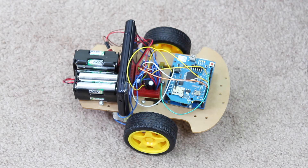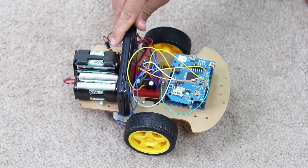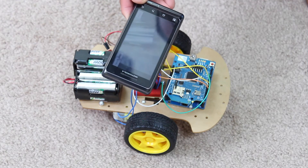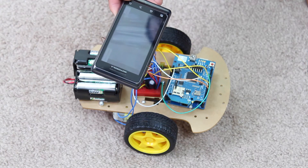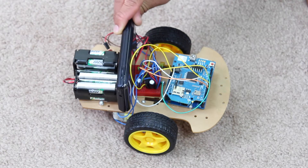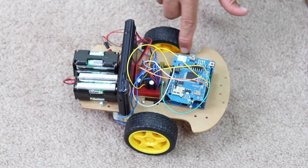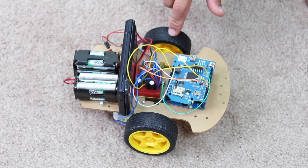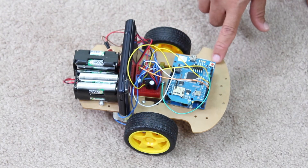For the camera, Wi-Fi IP cameras are about a hundred dollars and I didn't want to spend that, so I repurposed an old Android phone — a Droid 2 running Gingerbread. I installed an app called IP Webcam and turned it into a Wi-Fi IP camera, which I could hit with a URL and access the view on my app. For the base of the car I ordered a frame with two wheels, two motors, and a small third wheel from China for about eight dollars. It took four and a half weeks to arrive but it worked really well.